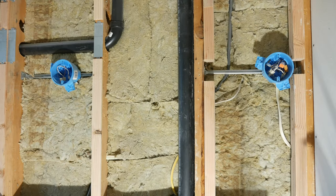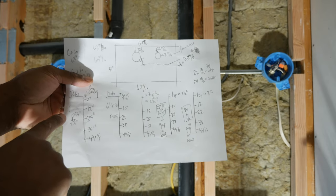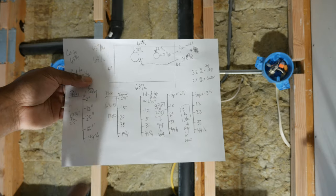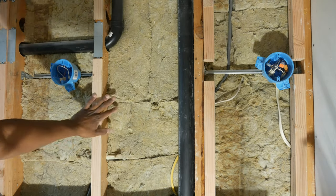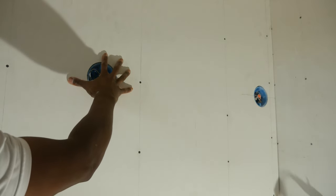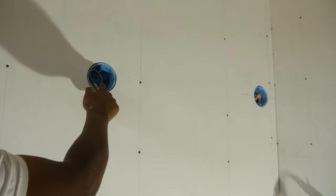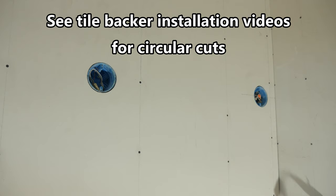Because there are so many obstacles in this wall — a ton of plates and pipes everywhere — I made a little guide for myself. This column on the first stud lists plates, telling me the first one is at 17-3/4 to 23 inches from the top of the wall, and the next column shows all the screw locations I planned for that first stud. I did that for all the other studs too and marked out the gaps. The top sheet is now installed. The box is a little chipped because I tried to cut with the Roto-Zip with the board in place and messed up a couple of times. I decided to just make the cutouts in the wallboard in the garage, take precise measurements, and then come in and install. That actually worked out — got it right the first time after wasting a couple of boards.